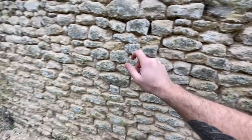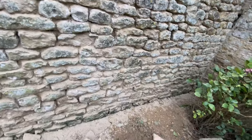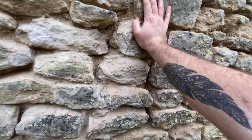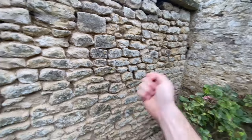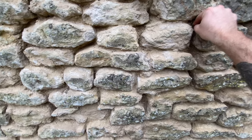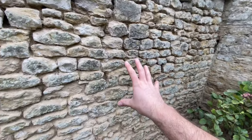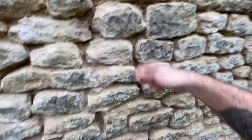It's just one of them days where we're really raking it out. What we'll do after we've got to this stage is get a hose with a bit of a jet, jet it all out, brush it all out - really get as much loose stuff and debris out as possible. If you prep this really well, the pointing is not going to take long at all, it'll just be quick. I haven't repointed a wall like this for a long while, but we've still got quite a bit to peck out.